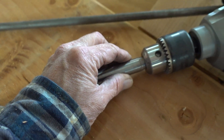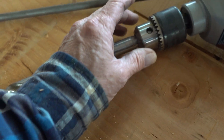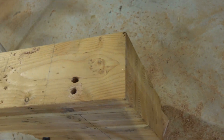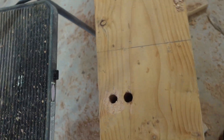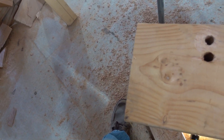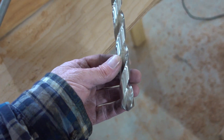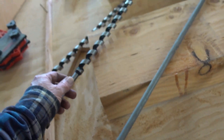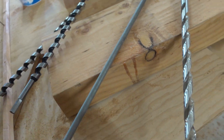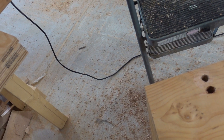It's working just absolutely fine. I drilled a half inch pilot hole and then went with the three-quarter inch, and it worked fine. This three-quarter bit is two feet long, and then I ran the three-quarter inch ship auger in the three-quarter inch hole and finished boring it out — nice and straight and smooth.